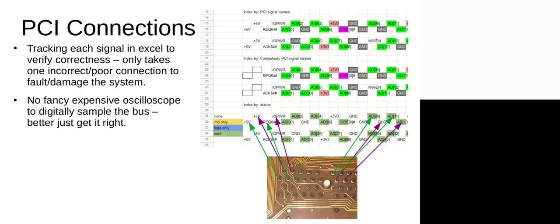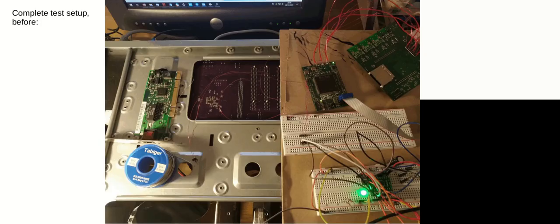To actually connect this thing you need a map of exactly which pins you're going to connect — I did that in Excel. I don't have much equipment, just a digital oscilloscope, so it's really crucial to get this right. This is the setup on the test bench: the computer on one side, exposing the PCI data bus to the FPGA and breadboard. It started with going back to front with a soldering iron for point-to-point connections, so you don't desolder what you've already done. This took about a day — solder it, test it, solder it, test it. This is what it looked like when done: the whole FPGA connected to the PCI bus, like a slot-in card.